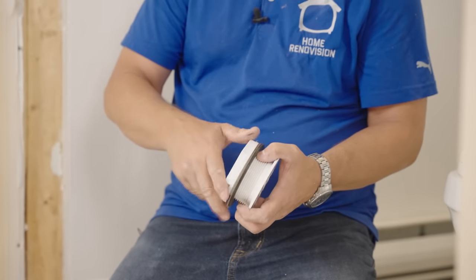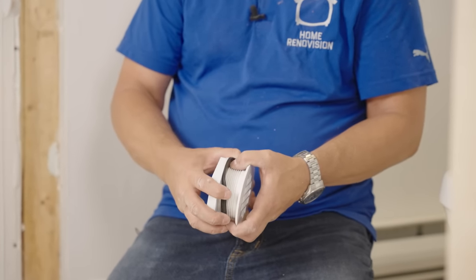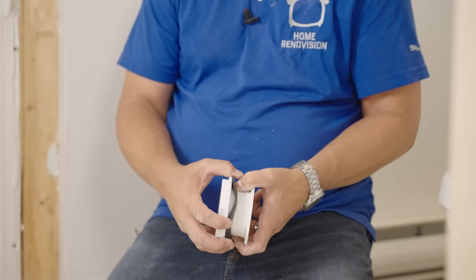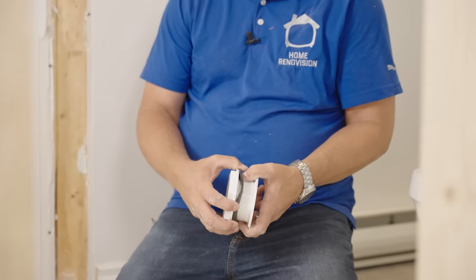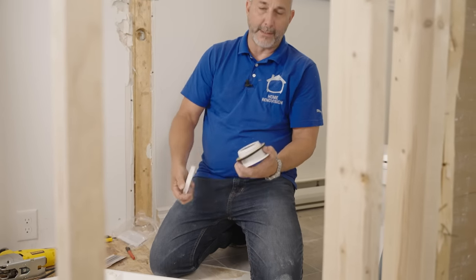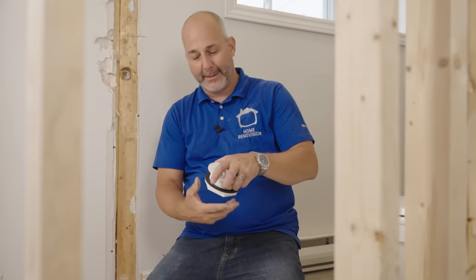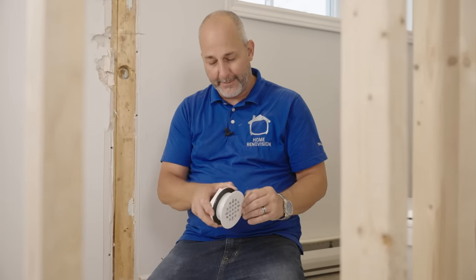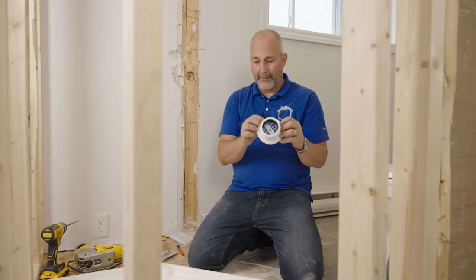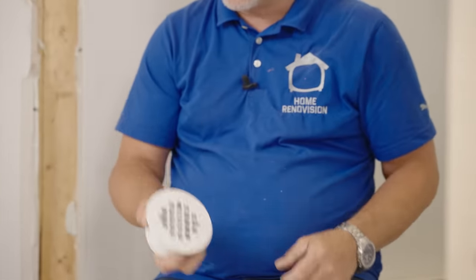This is a wax slip ring, which allows this torquing motion to slide on the cardboard. Without the cardboard, the gasket under pressure would buckle. This cardboard ring keeps that buckling action from happening. It's also on the dry side of the shower base, so you've got nothing to worry about. Nowadays we're using a clear silicone bead here and compressing that into the shower base.